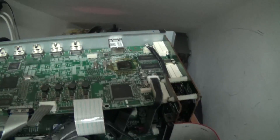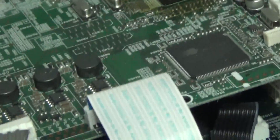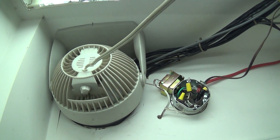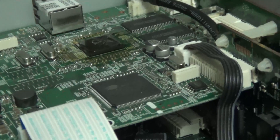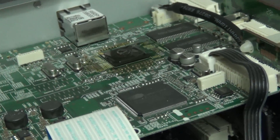There's how you fix a BGA chip reflow using nothing more than a light bulb. Now the thing that causes this problem to begin with is heat. This unit's got a nice ventilated top cover, and I've also got a cooling fan running in my closet all the time, so it never gets that warm in here — but the chip still gets hot enough that they fail. This is a very common problem on these units. I'm thinking what I'll probably do is get a little computer fan and mount it on top of the case to blow air right down into this vicinity of the unit — just a little muffin fan — to keep the chip from overheating.